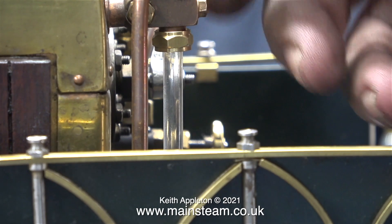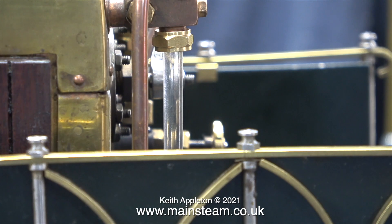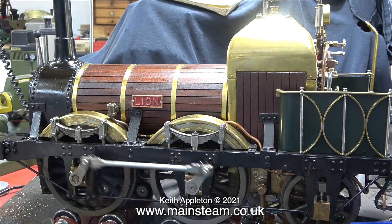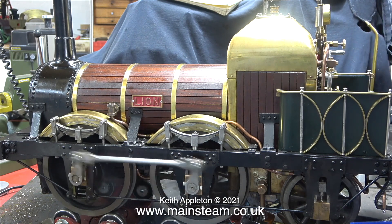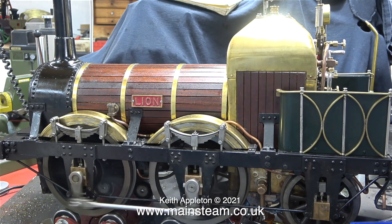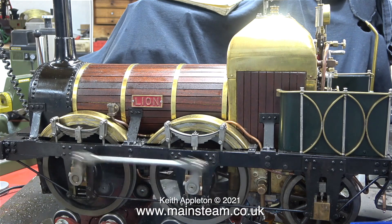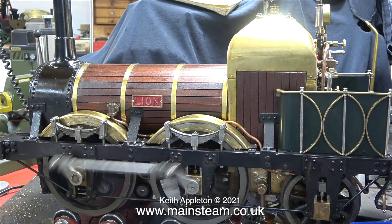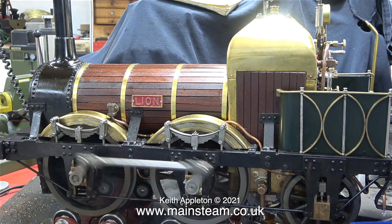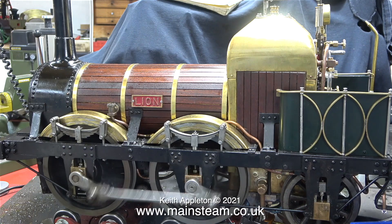What is more remarkable is the fact that the engine is running and pumping water into the boiler — the gauge glass shows that the boiler is now full and the pressure isn't dropping. Believe me when I say this is definitely not normal. I'll speed up the engine and see if the pressure drops. No, the pressure is still not dropping.